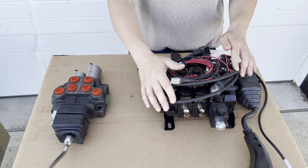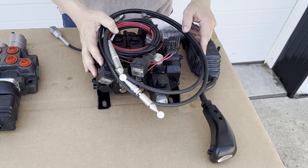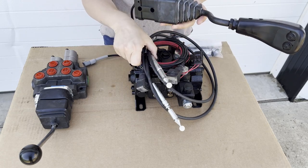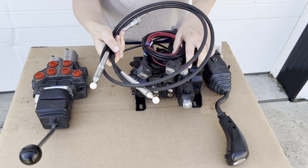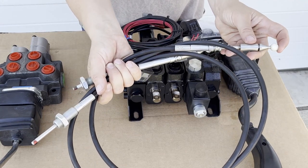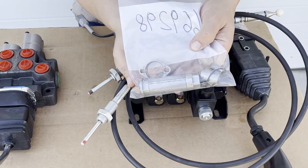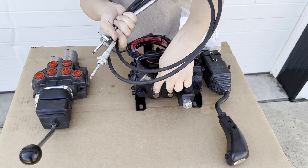The same principle is true with the setup on a tractor with a cab, but because there are more components, it's a little more complicated with how the movement of the joystick results in movement of the loader. You have a joystick which moves in multiple directions, and the joystick is attached to the valve via cables. You can see here that the inner cable moves — this end is attached to the joystick, and when the joystick moves, it pushes the cable in and out. This cable tip is attached to the control valve where the spools are with cable connection hardware, and anytime the cable is moving, the spools are moving in and out and directing oil flow.